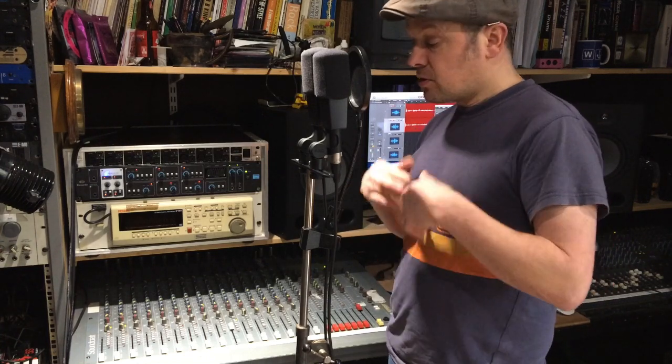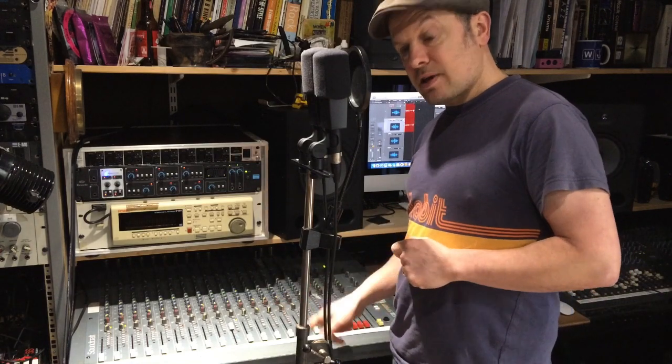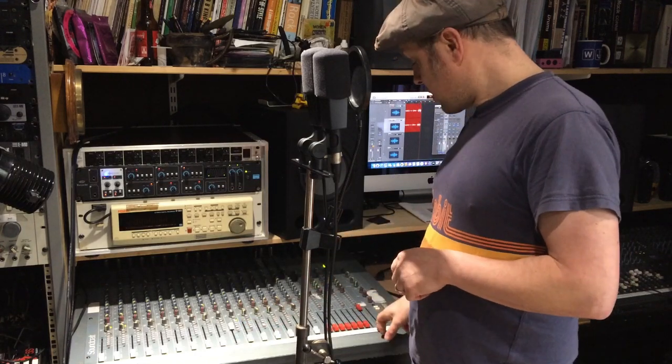I'm going to perform a little experiment. I'm going to say one, two, three, four four times into the computer, and at the top of your screen you'll see which mic I'm on — either the one that's gone straight into the audio interface, or the other one which has gone through all of these analogue gain stages: gain, an EQ circuit — and although the EQ is flat, Soundcraft didn't include a bypass switch — then through a fader, then through another amplifier into the output bus, which then feeds the computer. There are quite a lot of resistors, capacitors, chips — all sorts of things that can destroy the signal on its way through.